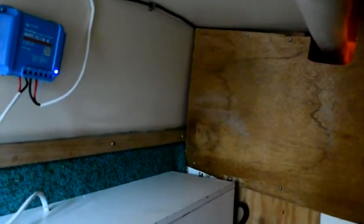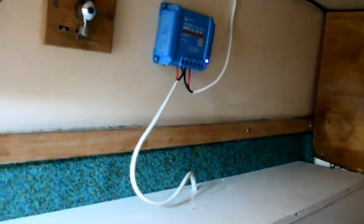There are 120 amp hours each, so we have 600 amp hours of batteries altogether — they're being charged. The boat went in on the 15th, a little over 75 hours ago, but there have been a couple of nights intervening. It went in on Tuesday and it's now Friday. I've got my smartphone here which I'll link to the solar charge controller via Bluetooth. We're getting 36 watts from the panels. Panels are currently operating at about 17.6 volts. Voltage in the battery bank is 14.3 — it's just gone into absorption mode; it was in bulk a few minutes ago. It's currently charging at two and a half amps.